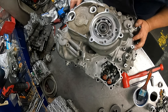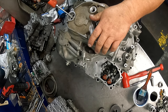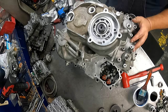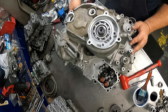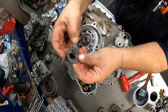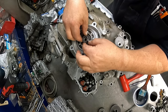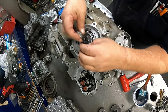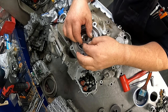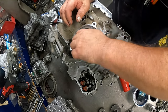Okay, I think we went down, and you can pull up on this shaft, and the snap ring should pop into place. This shaft here, we have the X again. Splines have to spline in the spline. The X needs to be up. And this one's right-handed threads.